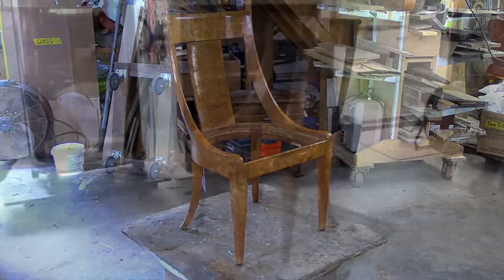The tops keep looking better. These have dried for about 4 hours, and they seem really dry. I'm going to put another coat on. And this time, I'm going to use the satin, because I'm hoping that this is the final coat. This coat, it's interesting. I'm keeping this pad really, really tight like this. And this coat seems to be going down almost streak-free. It looks really good. It definitely has a lower sheen. All right, I'll let this dry overnight this time and see what it looks like tomorrow.